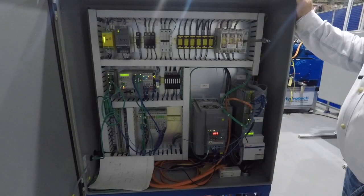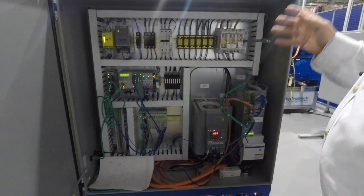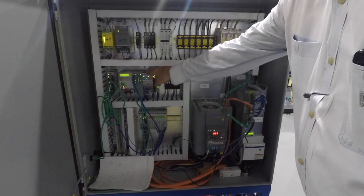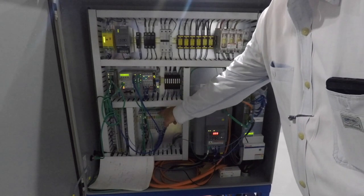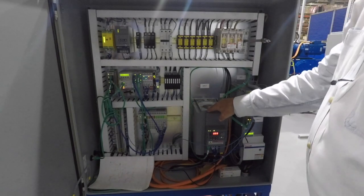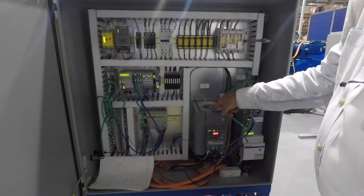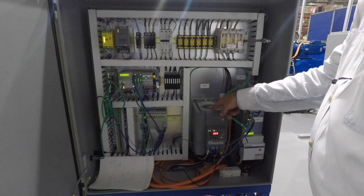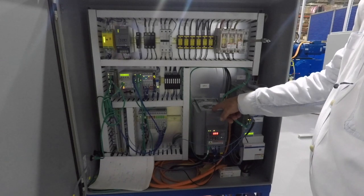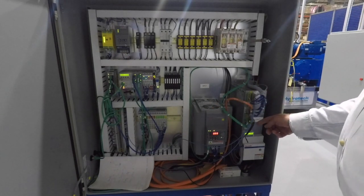I just want to give you a quick look at what's inside the cabinet. We have a safety relay and a power supply for the safe torque off on the motors. There's the MLC-H controller, which is an L45, with an H block for the proportional valve on the Rexroth side. We have a VFD drive for the induction motor, commanded via the MLC via PROFINET — we could do Ethernet IP or Sercos, but I chose PROFINET. And then we have the intelligent PFC drive, also commanded via PROFINET, though it could be Ethernet IP.